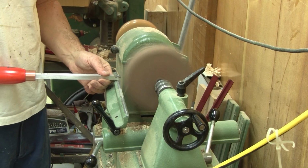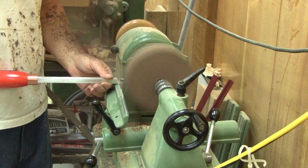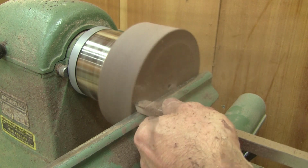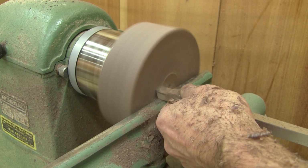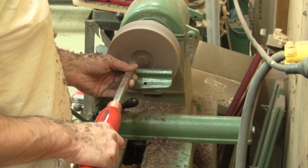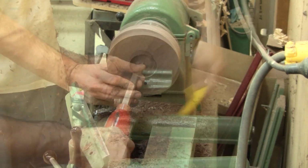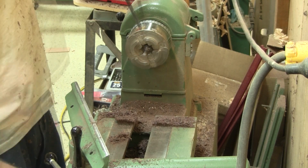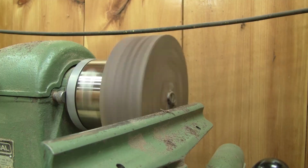Then I insert the screw into the turning chuck, use the tailstock to help hold it in place, and turn the exterior round. Then I make sure the bottom is straight before making the hole that will hold the bowl to the chuck. When it's done, I unscrew the bowl, remove the screw, and chuck the bowl to the lathe. Then I can remove the interior of the bowl.